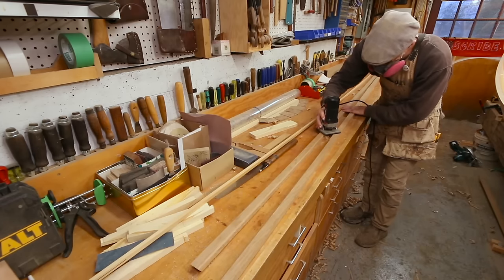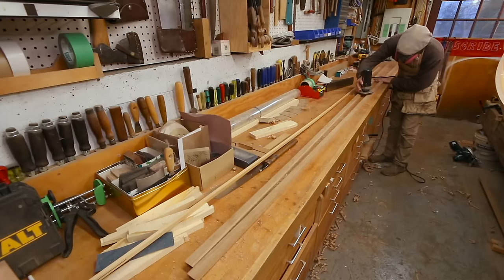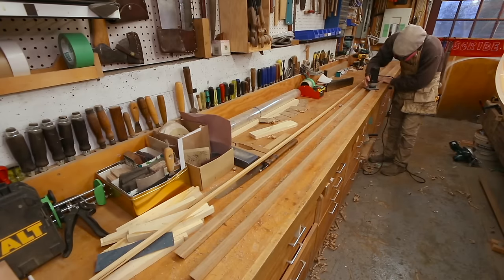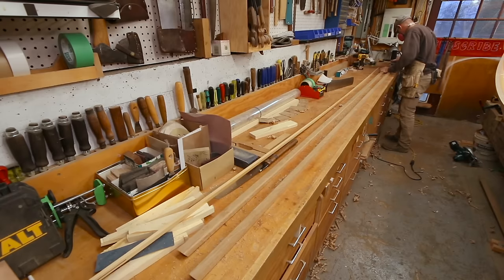When putting molding details on long skinny things, I'll often stack them together with the molded faces facing each other, and then the router can bridge the two of them, and it gives you a nice stable base. And I'll just do it in short steps, going down one side and up the other, sometimes using climbing cuts as well in order to reduce tear out.